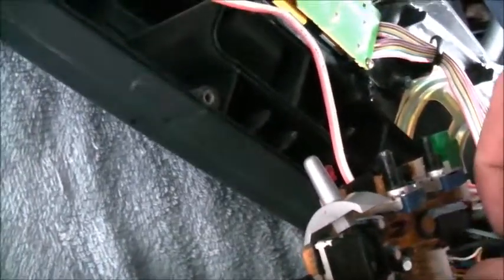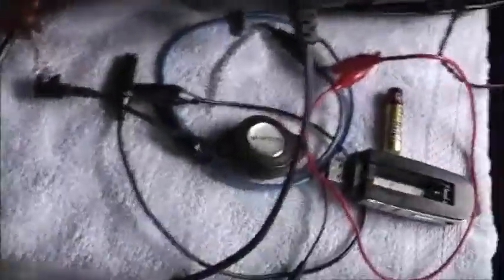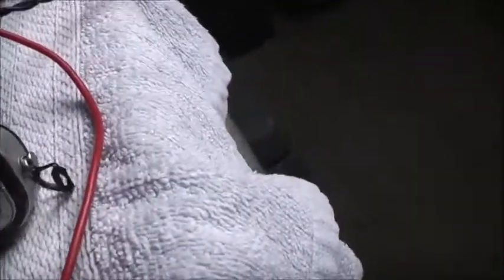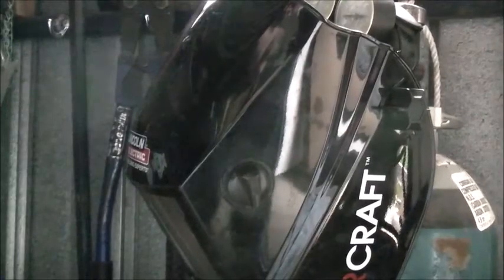Let's get some wires tapped to it. We'll see how it sounds. In some cases it won't sound that good, but we'll get a tap in further under the actual amplifier because of how the head reacts. So we've got these wires here — yellow's right, red's left. Let's get some connectors from somewhere and see what I can dig up. I've got those soldered up. Working. Now I think to get this to sound right, I'll have to make up a circuit that disconnects the tape head at the same time this is working, because this will also go through the tape head and that can distort the output signal. Let's see how we go. We'll bypass the tape head — make a circuit to switch and bypass that.